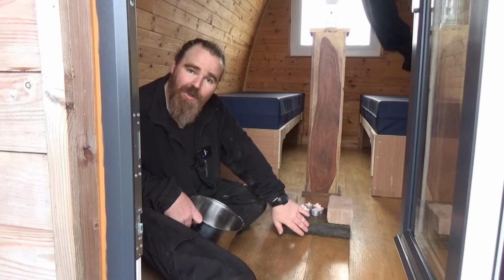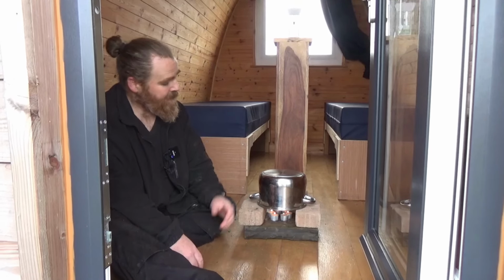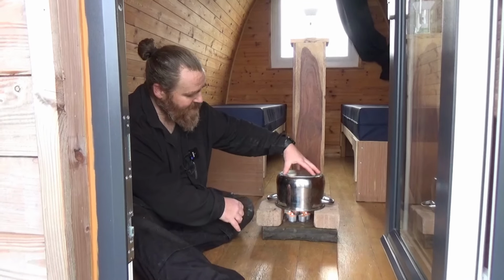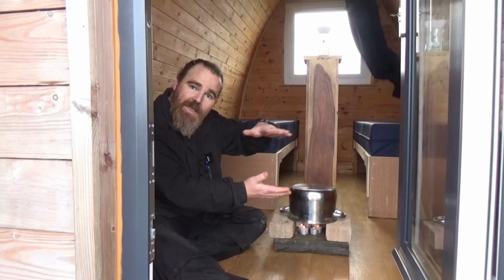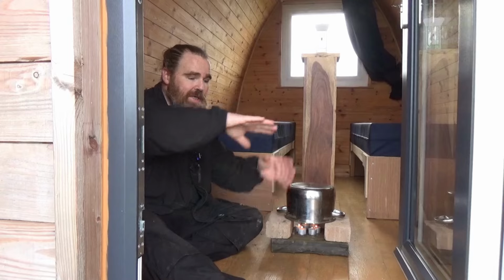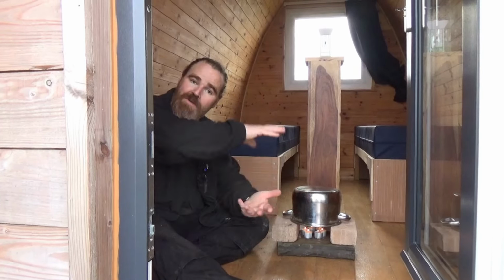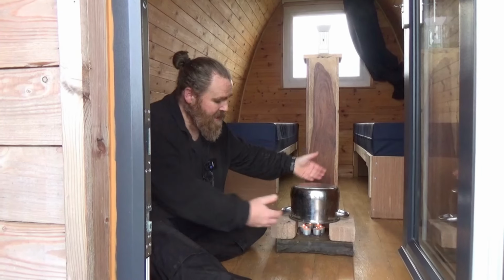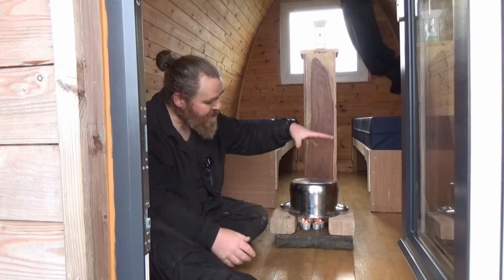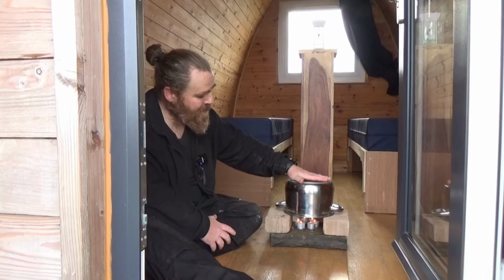Now, the way this works, and the way it works more effectively than just burning 6 candles in a fairly small space, is that hot gases come up and they fill this chamber, they fill this pot, because they're lighter than room temperature air. Now, if we inverted the pot and filled it with water, of course it'd fill up and overspill evenly all the way around, because that's heavier than air. We're just inverting the whole thing so it'll fill with hot air all the way to the bottom and then evenly spill from underneath. But meanwhile, this pot is full of hot gases, and it'll heat up.